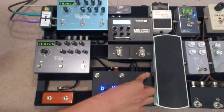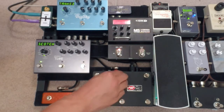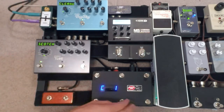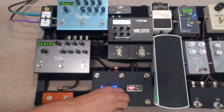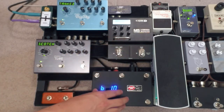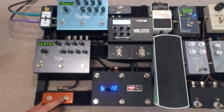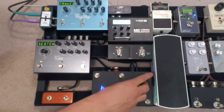How you set it up is you're going to hold down just like you would set up a preset on any of these four originally when you're in your bank mode, and this is what gives you the option to go in and edit it. I don't want to mess with this too much because I actually have a favorite sound. I like my tank spring reverb, my tape delay, and bypassed on the M5. This one is the bypass command as well. As I explained in a previous video, the M5 doesn't like to receive bypassed commands when you disengage out of a preset, so I had to make a page that was just a noise gate with the threshold all the way down and it bypassed over here, so that way I could have a bypassed setting on here.